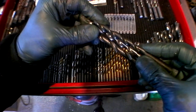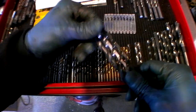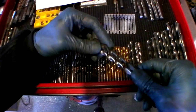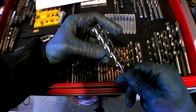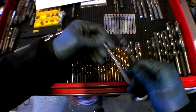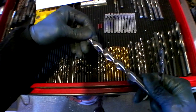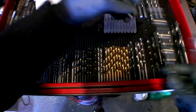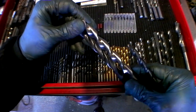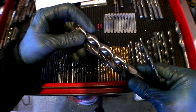Now these do work really, really well. I believe I got these from Fastenal, and they work really well. It just gives more room for the chip to exit the hole, and they're specifically designed for deep hole drilling. I've got some here at five-sixteenths, I've got one here at half inch — you can see the difference between a cheap half inch drill bit and this one. They work really good for kicking the chips up out of the hole.